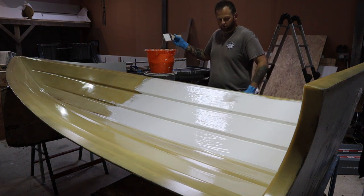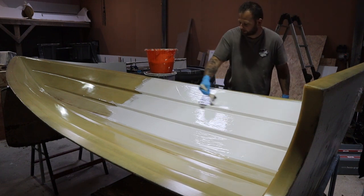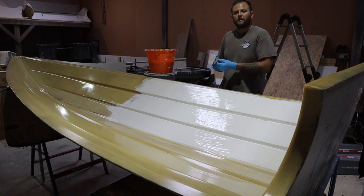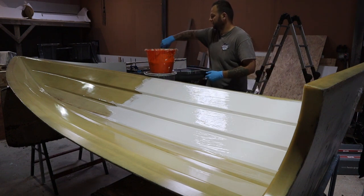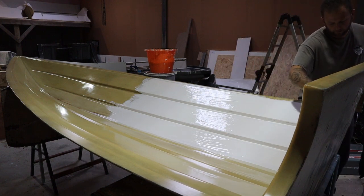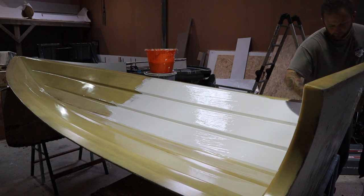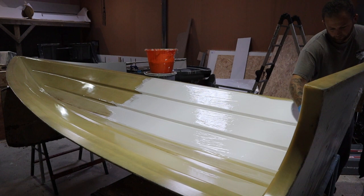And although the coverage looks nice now, you'd still be able to see through this if you were to pull it out of the mould as is. Even when you do two gels and the glass, you can actually see through the component still in some cases. Once you get the lockers and everything painted inside, the likelihood of it being seen gets a lot smaller.